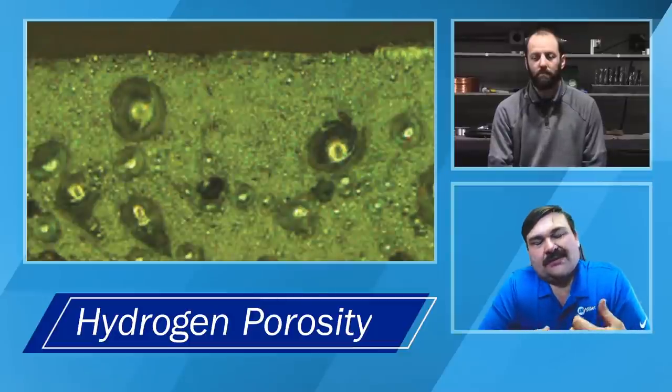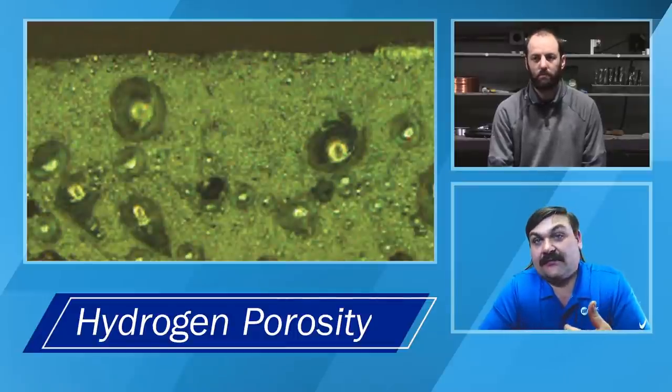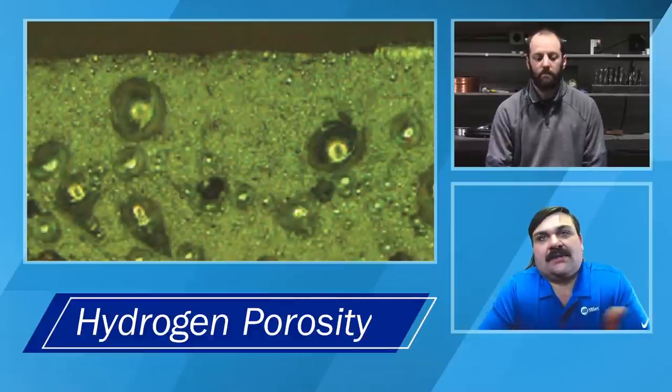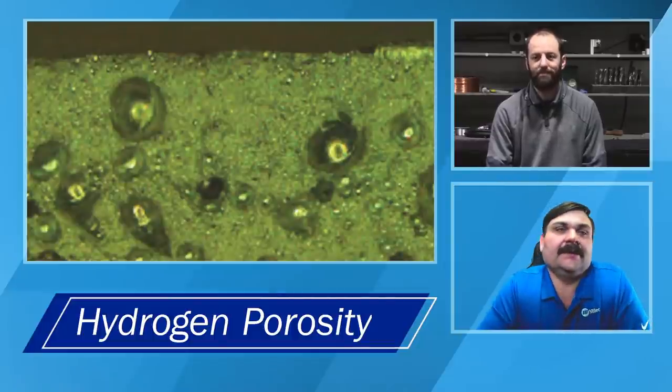As soon as the part is welded, or even if you wire brush it and let it sit out in the open, that is going to start regrowing itself immediately. So even a part that you wire brushed yesterday, best case scenario, we're going to want to clean that again before you start welding, because that oxide layer is always trying to grow itself.